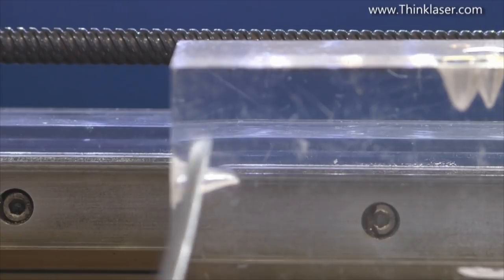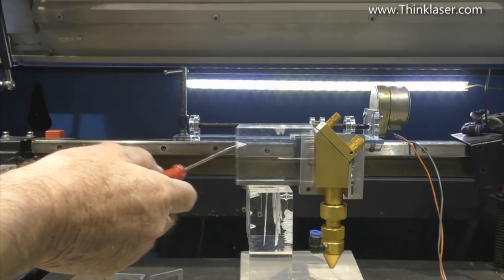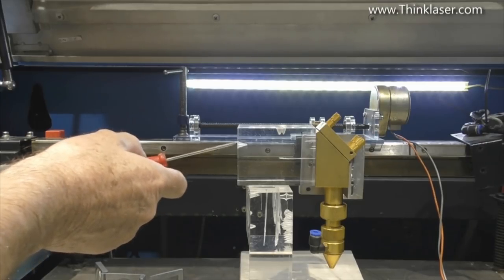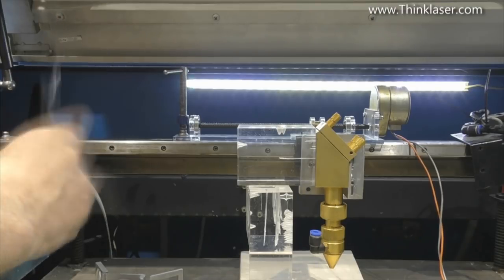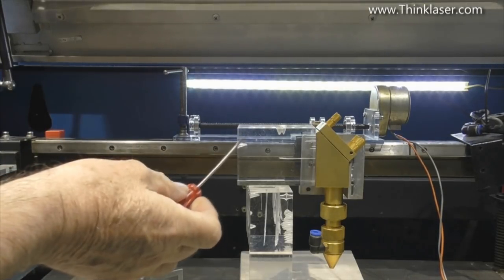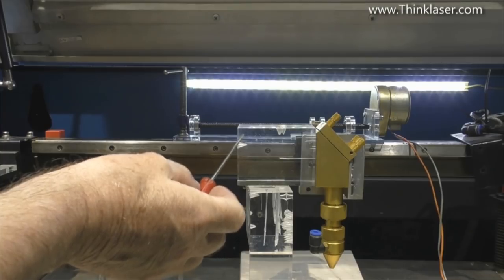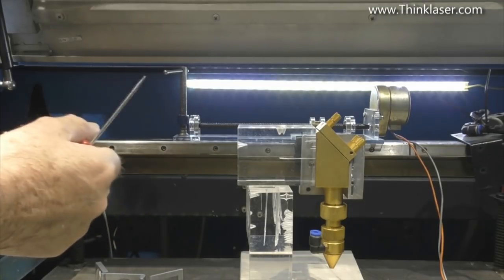Here's what we've just produced: we've got a point at the bottom where the high energy density is in the beam, but as we get further out we get lower and lower energy density. Notice that it was only when the beam was well established and we'd burnt quite far in that the high-energy part doing evaporation was not the part causing the liquid. The liquid was only happening right at the outside where the energy is very low, but it happened a long time after we started the beam.